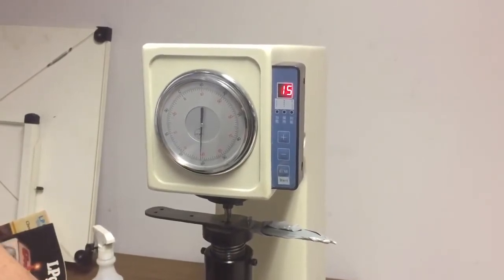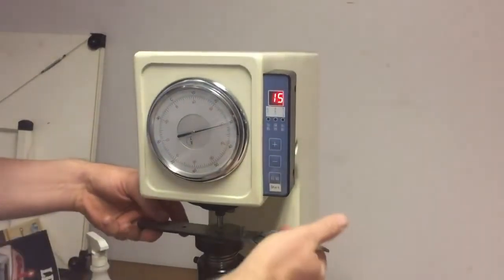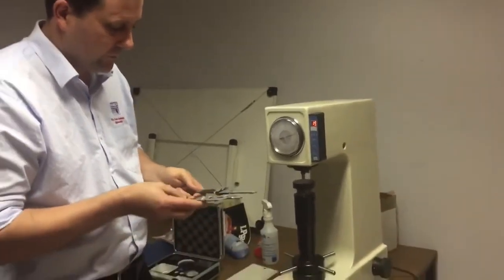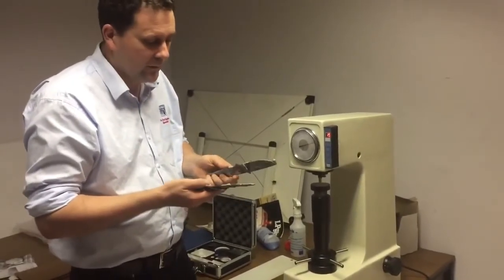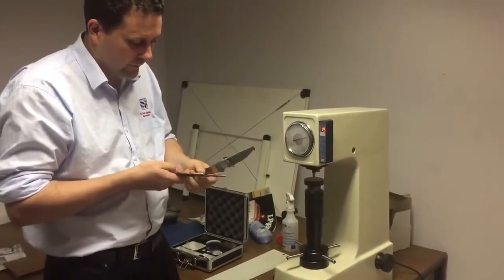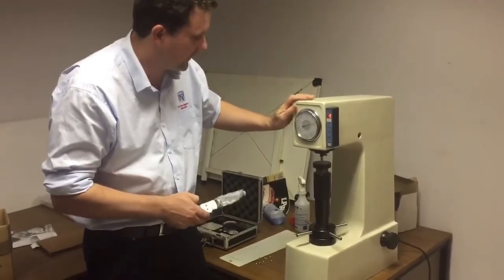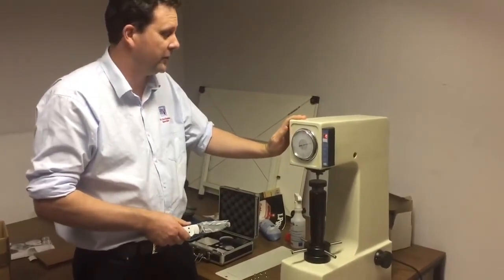So 61.5 is probably a realistic figure for these knives. He was shooting for 59 so he's a bit over, but you can always temper them back. Once you've tempered down you can't come back up without a proper heat treat, so he's in a pretty good position. You can put these back in the oven at a slightly higher tempering temp if he wants to bring them down. 61 is a pretty nice knife for the intended application, which I believe is hunting — it's going to give excellent performance. If you're serious about knife making, serious about getting your blades right, and want to assure your customers your heat treat is on spec, this machine is the one.